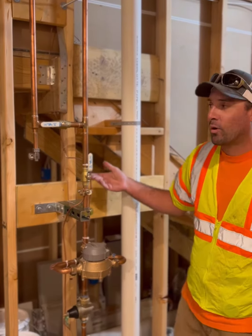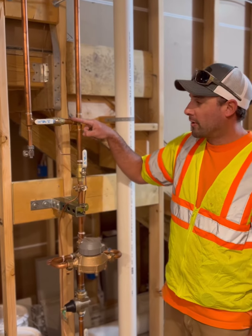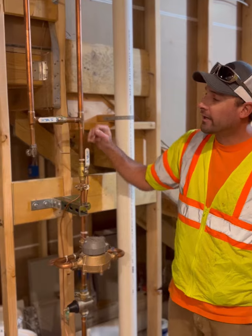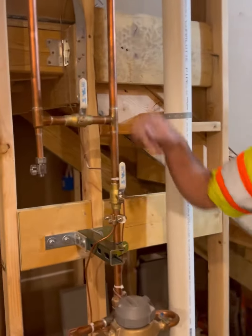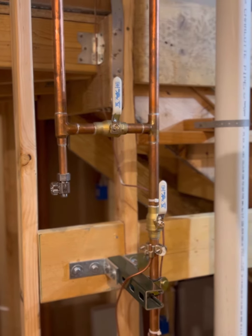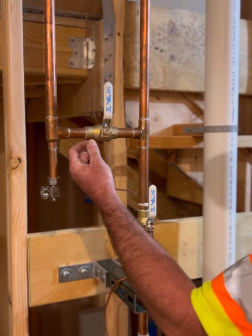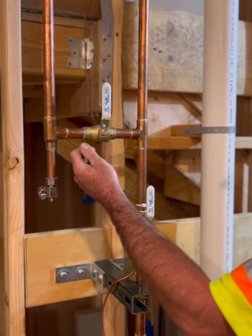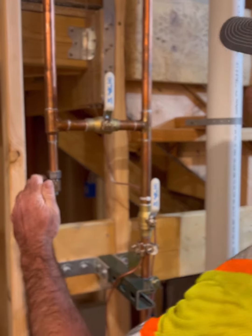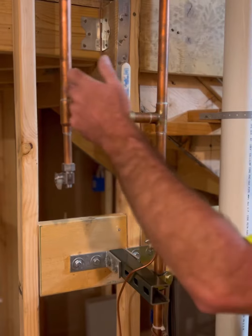This will be your main water supply coming in. Usually there's a T coming across into a ball valve. This is on right now — that will be off. You will want to shut that off for your winterization. Sometimes you will have a drain like this here, or there's going to be a screw-off drain here. Either way, you'll want to shut this off and open that so it will drain out the system.